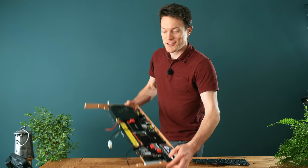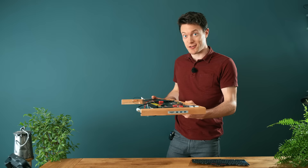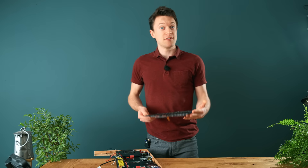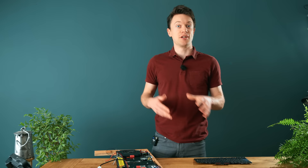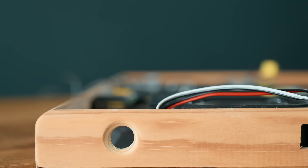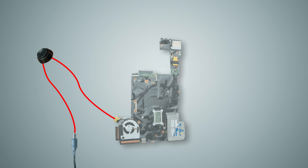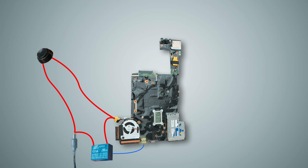At this stage the system is almost ready, but there is one last important thing left to tackle, which is adding a power button to turn it on with. I don't really want to leave the keyboard — which has the power button on it — connected, as it would make the thing look a bit bulky. So instead I'm going to take advantage of the BIOS power setting that enables the laptop to turn on when it detects it's receiving DC power. I routed the power through a momentary push switch. Normally this breaks the circuit, but once pressed the power goes through to the laptop. The USB ports then start receiving power, so I attached a relay to one so that it takes over from the momentary push button, keeping power to the laptop once the button is released. When the system is shut down, the USB power drops out and the relay clicks off, disconnecting the laptop and leaving it primed, ready to be turned on again whenever needed.